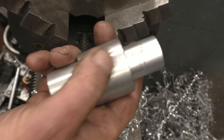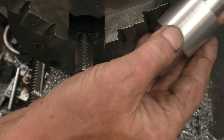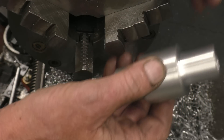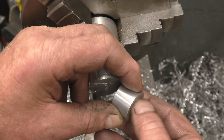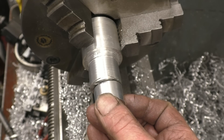Right, so that's what I'm doing. I haven't put massive chuck marks on it — it doesn't matter anyway because it's going to be moulded into some plastic from what I gather. But that's the first one done. Before I'm finished with the length of aluminium I've got a little spacer I've got to make, just one mil longer — I'll get it out of the end of this piece.